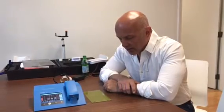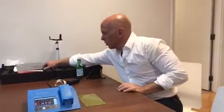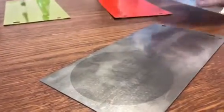Hey everybody, just wanted to touch base with you about a new pretty cool tool that we've got. If you've watched my other videos, we've talked a lot about how depth of plates is really critical to the process of pad printing, and what you're always looking for — whether you're using a thick steel plate or a thin steel plate — is an etch that's 25 microns deep.